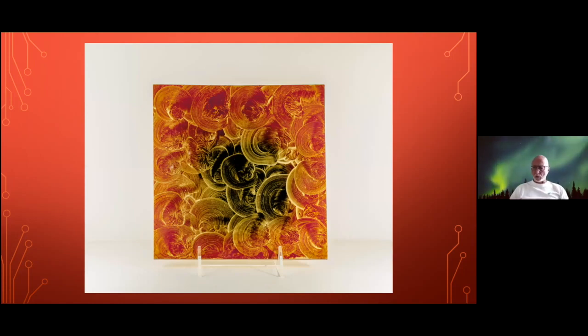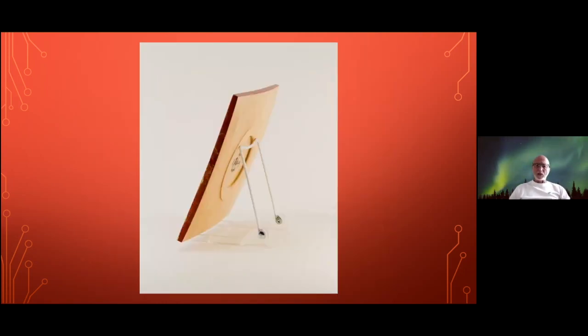This is a six-inch square maple platter that I painted to try to emulate lacquerware. I've gone through a couple of iterations of this — I did one on the same piece of wood and turned it off because I didn't like it, then repainted it. The short version is this has both black and red rattle-can spray lacquer, and then on top of that is acrylic, which I put on with a brush. I decided to paint the edges too, which I think made it look nice.